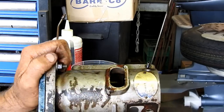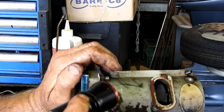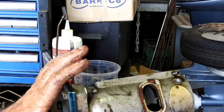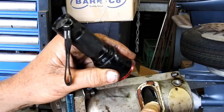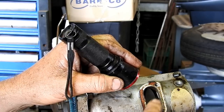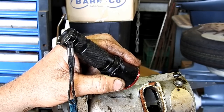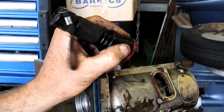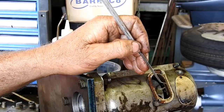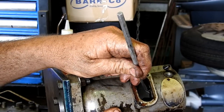So, look, what we do, I'm going to tidy this pump up nicely for this fella, and we're going to actually bead blast the housing. So, I will pull the basket out, but what it's important to do is scribe a line exactly. You can scribe a line on both or just on one. So when we put that circlip in, the circlip goes to the exact same place again. So I'll just get my scriber here. You use an engraver or use whatever you like.